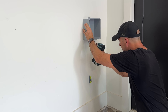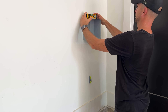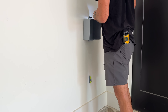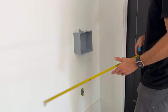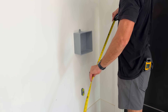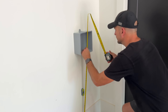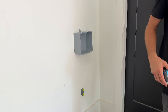Here is the cavity I want to hit. I found the stud that I'll use to mount my inside 8x8 PVC box, and then I have an 8x8 PVC box on the outside, and we'll drill the holes between these two. So first I just want to locate everything — get a bearing on where the middle of that box is, where the stud is, and where I'd want to place the larger hole in the box. I'm going to favor the lower left-hand corner, and I got my measurements which I was able to correspond with the outside — everything looked good.